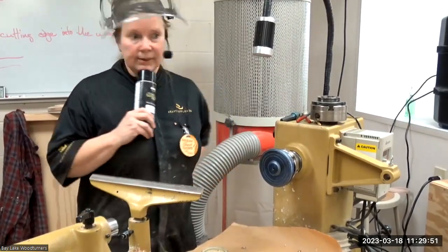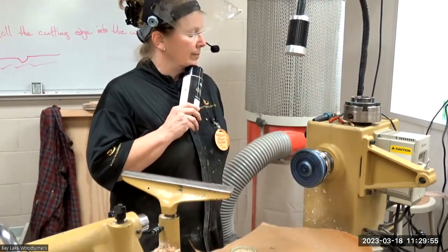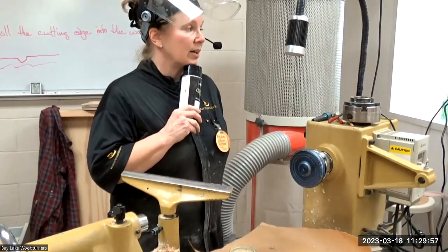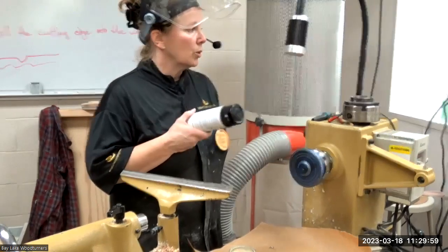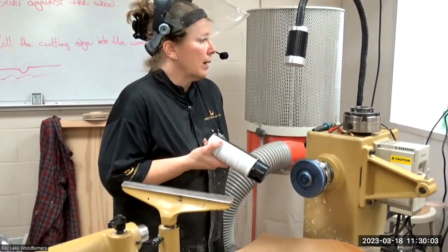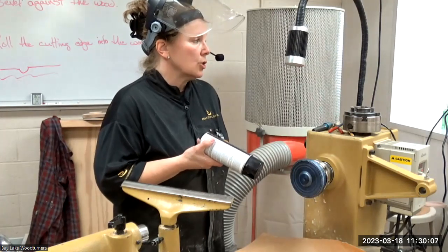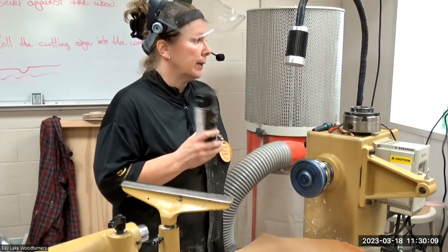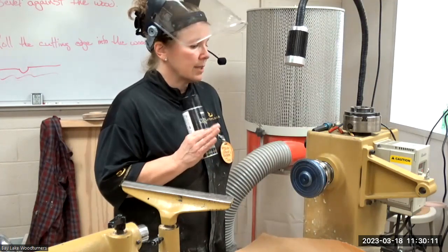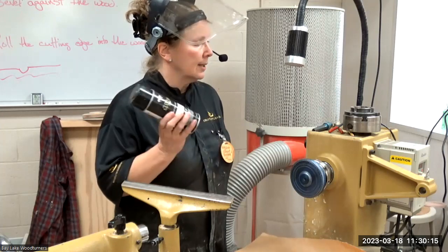Did I forget anything? No, I basically just wipe it off. Because like I said, the more you work it, the more the blue goes, and you might want blue on blue, you might want that wax to turn a different lighter blue to accentuate, depending on your color. But for the most part, I just work it as little as possible, get it in the nooks and crannies, wipe it off, and then shellac it.